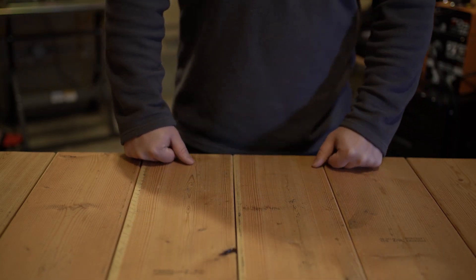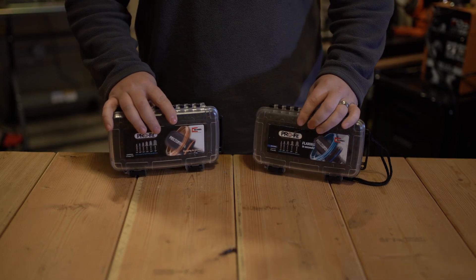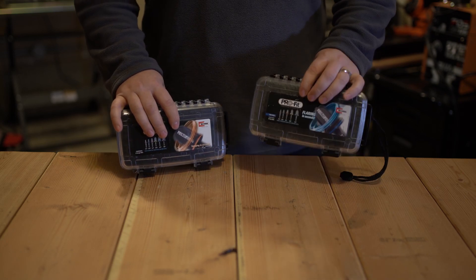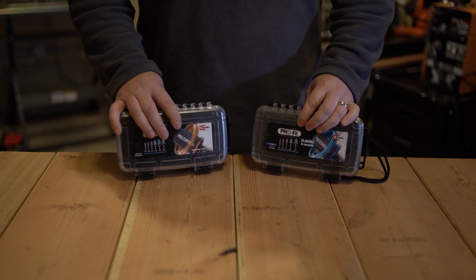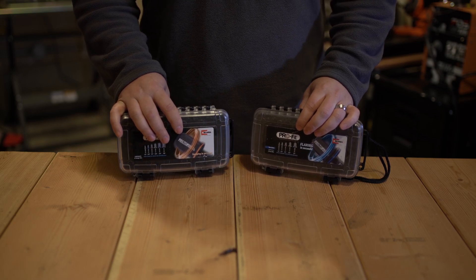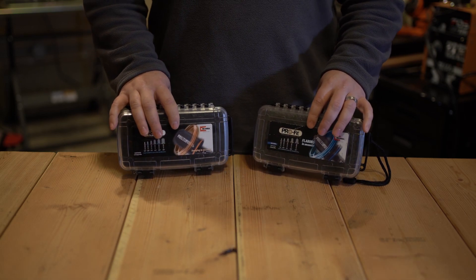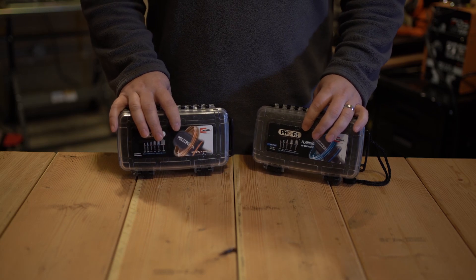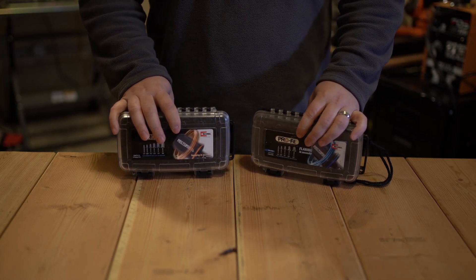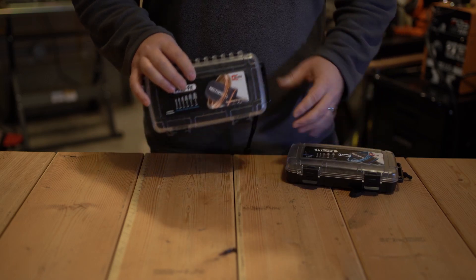Make sure you stick around, like, subscribe, all that good stuff. Today we're going to be talking about spin tools — we've got the spinning swedge and the spinning flare. Spin tools have been around for a few years. I know a lot of guys really like them, some guys hate them. I'm kind of in the middle — I really like the swedge, I don't really use the flare too often. We're going to test it out on a couple different tools: a 12-volt impact, an 18-volt drill, a 20-volt impact, and a 20-volt drill. Manufacturers typically recommend using a drill with at least 1800 RPM, and it's not recommended to use an impact, but we're going to see if you could use it if you had to. For myself, I prefer to use the old school flaring block, but the swedge tool is great.